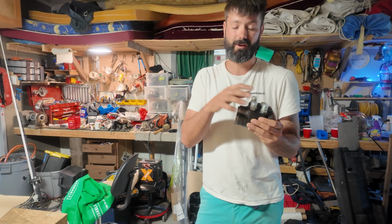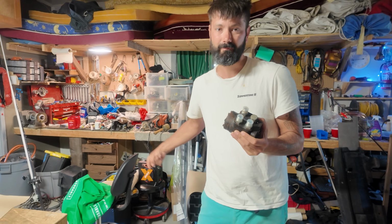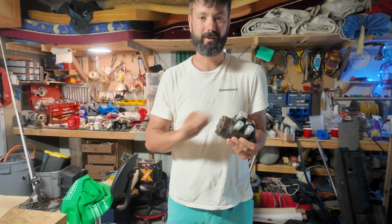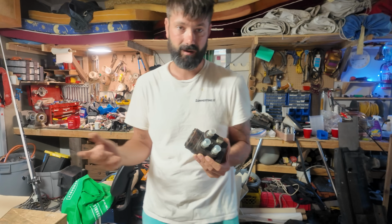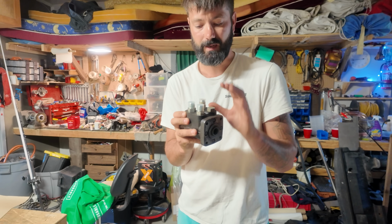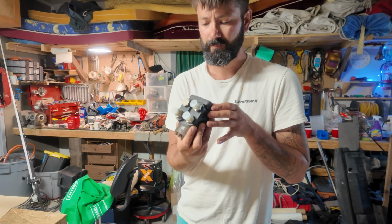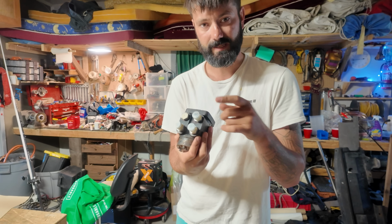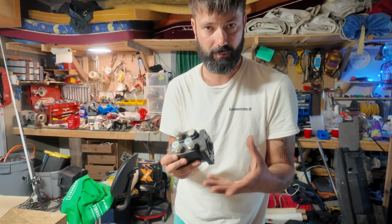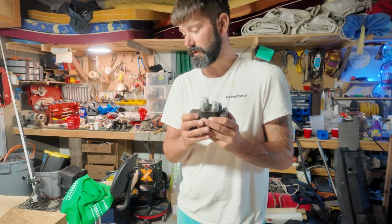You could run them all in series, so you do 2 lines and one goes to the helm and then down to the rudder and then back up to the first helm and then pump it all around in a big circle, basically like a rope or wire, a steer-by-wire system. But that's not the way most of these are done. They're done with a center feedback. It makes filling them a little bit easier. You can put a reservoir because the return line is low pressure. It's not pressurized at all. So it's a great spot to put a fill. So we're going to do that as well.